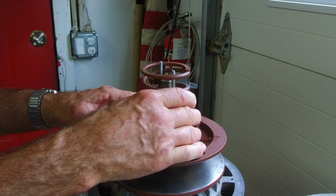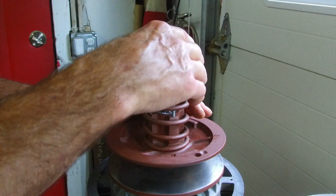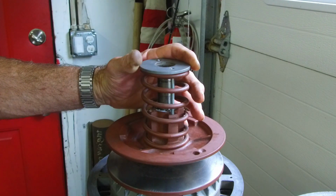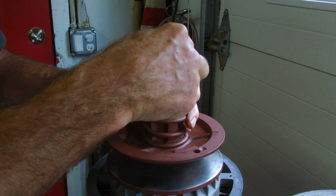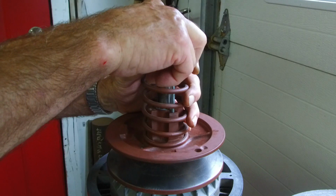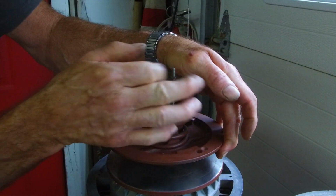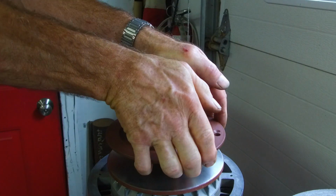I'm going to put the spring on here. And then we're going to go ahead and put that. All we needed is enough to grab those nuts. Now these are just grade 2 or 5 on the all thread, on the strength of it. It's what I got down at the hardware store. It's what I used to remove this, so I don't think it's an issue with how much compression it needs to have. And I can almost push this right on down here by hand and then just crank these down just to hold it. There we go.